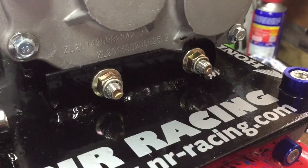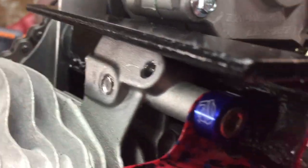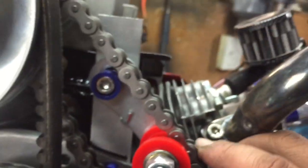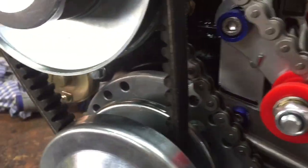I just made a top plate from some angle iron — those are the two mounting points. I caught this bolt over here, and those two there hold it pretty solid. It's real thick — I believe six millimetre thick flat steel. This bolt here is one of the crankcase bolts, and the other one's in behind. This aluminium flapper I used to mount the tensioner.